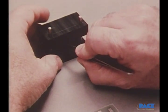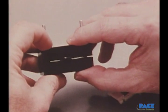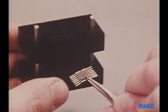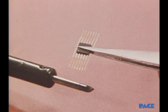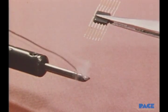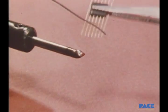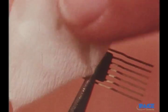The bending is done with a lead forming tool or a pair of duck-billed pliers. The leads may need to be trimmed for a proper fit. In some circumstances, the specifications may require pre-tinning of any gold plated leads. Pre-tinning will prove the solderability of the surfaces and will minimize gold solder contamination. When pre-tinning is not required, leads are first cleaned with solvent.